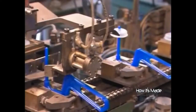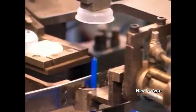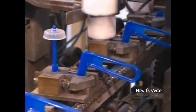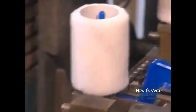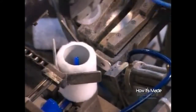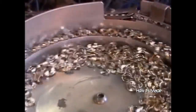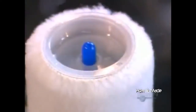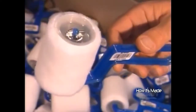These plastic bearings hold the components together. The assembly is entirely automated. The bottom bearing goes on first and rests against the part called the shoulder. Next, the refill. The bottom bearing slots right into the open end of the tube. Now the top bearing goes on. A metal clip locks the bearings and roller in place. And voila — a 7.6 cm roller for painting windows and trims.